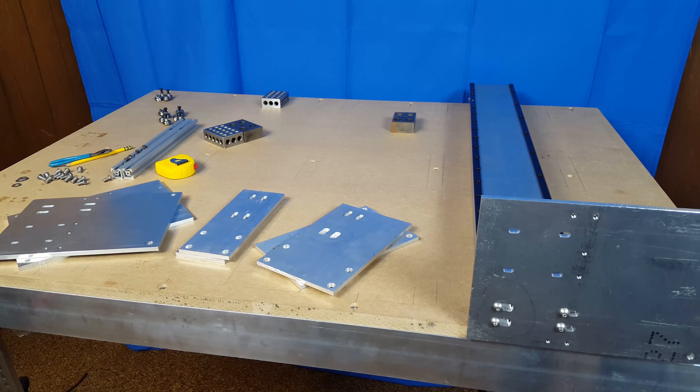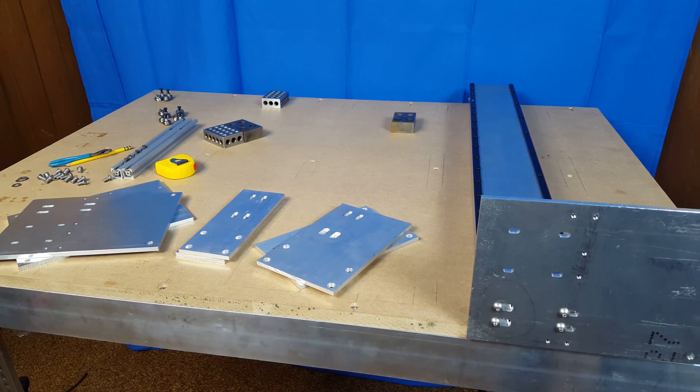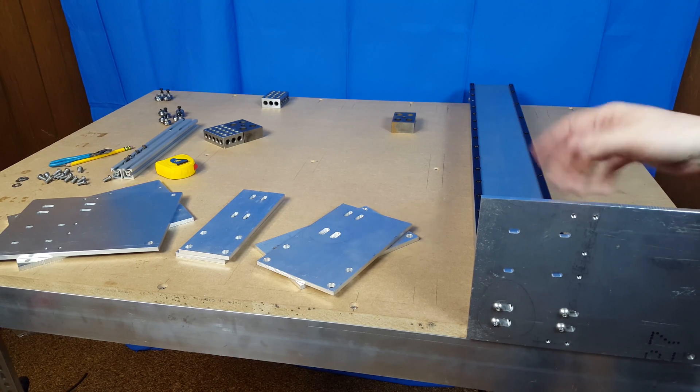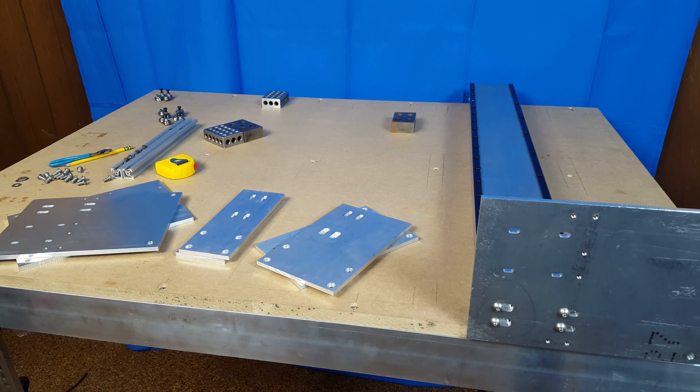So the next step is to just bolt on some of the plates to the rails and actually make sure that everything is square when they're bolted on. I noticed that this one is a little bit off, so I'm definitely going to have to get some shims in there to get it lined up a little bit better. I'm guessing there are probably going to be a couple more areas where that's going to be needed. So I'm going to do that and talk about it all after I get it sorted out.